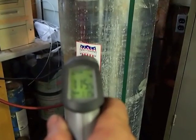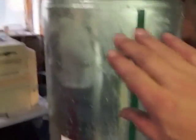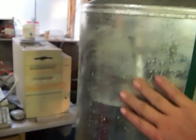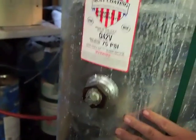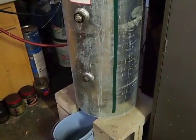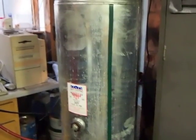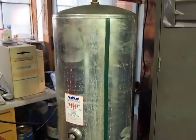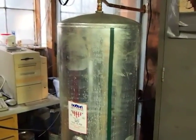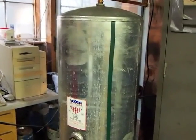That's more like what I would expect. The temperature in the tank varies — very hot at the top, still very hot at the label, and you go down to the bottom and it's kind of lukewarm. So that's the 95-degree temperature water returning to the wood stove, and basically it will cycle. It's called gravity feed — it will do it by itself and will constantly be radiating heat into the room, which is just what I wanted.